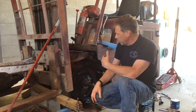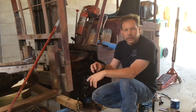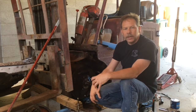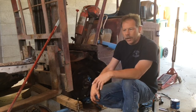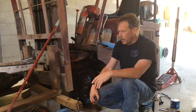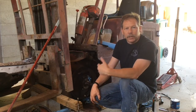Then I think I'm going to try and address the radiator — the cap doesn't seal. The neck has got some rust in it, so it doesn't seal and doesn't build pressure. If you run it for more than about 25 or 30 minutes, it begins to heat up. For as long as I've had it, I just keep adding water. But I think I'm going to go ahead and see about pulling that radiator out and getting that replaced as well.